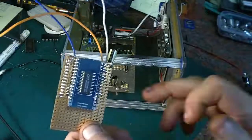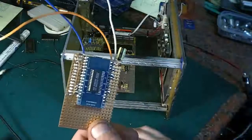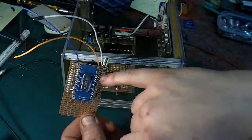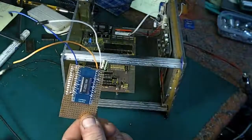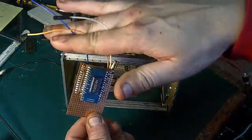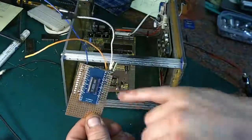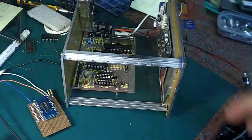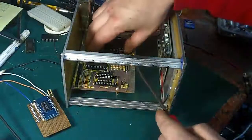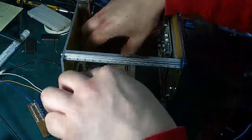Most of the pins actually line up between the RAM IC and the original pins on the board, but there are just a couple of address lines and I think the chip select line are in slightly different places. All I've done is cut the tracks and bridged over using the matrix board underneath to get all the same lines in the right places. Then we've got A11, A12, and A13 which we need to pick up off the ZX81 board — those are these three wires here.